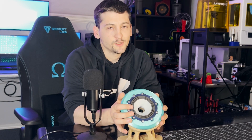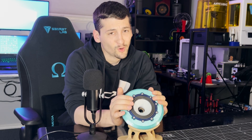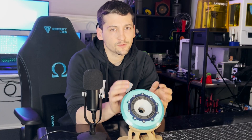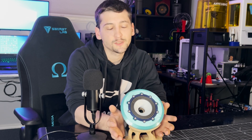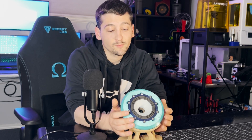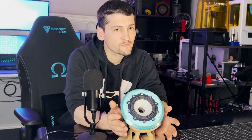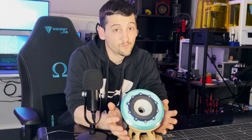Other than that, there weren't too many changes to the speaker itself other than it got smaller. It uses the same version 11 metal motor from the last speaker — I literally just pulled it off and put it on this one, and it'll probably be used in the next one as well. I went down to a 34 gauge wire on the coil instead of 30 gauge to cut some weight out of the moving mass. Total moving mass is floating around 11 to 12 grams on the scale, while the MMS is floating around 6 grams — way lighter compared to all the previous speakers.